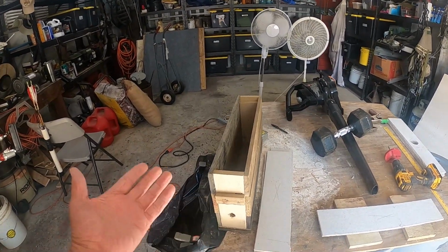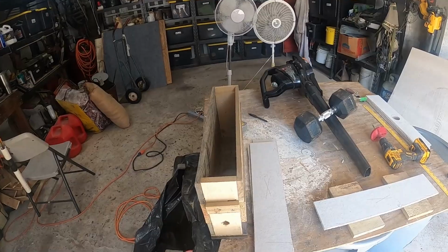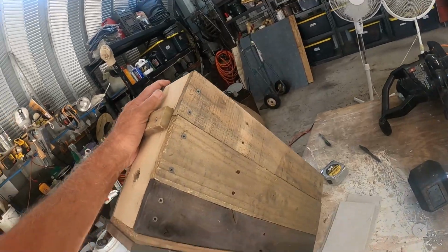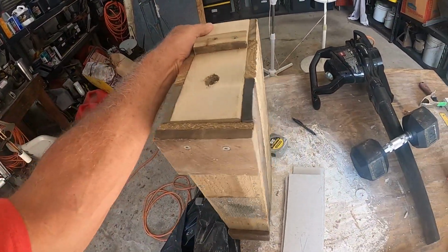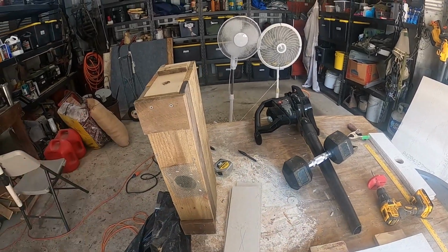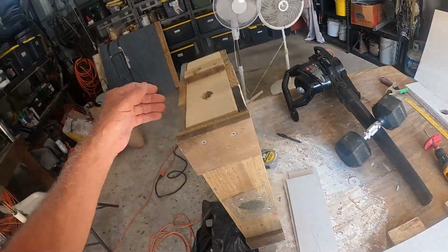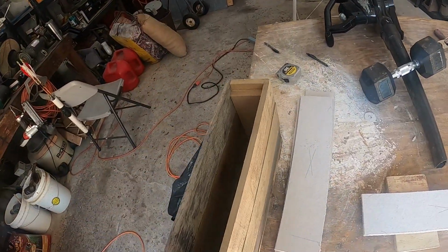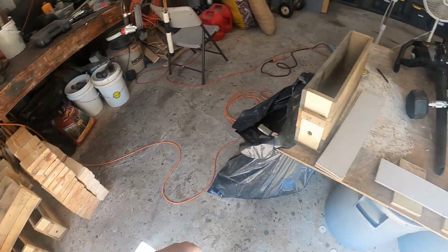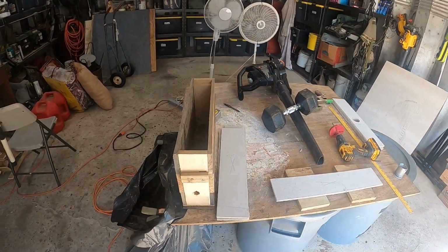I'm going to paint these, probably mix colors. I got a bunch of flavors over there. I got some white. Yesterday evening I set up my dip tank, and you'll see this has kind of a gray patina look to it. These two-bys were really blonde colored, but I dipped this whole box in and painted it up with Tall Earth, eco-friendly wood preservative. And then I let it sit out on the slab until evening, and then I brought them in here. I didn't want the morning dew getting on these boxes, so I set them here overnight. But they were basically baked out there in that sun.